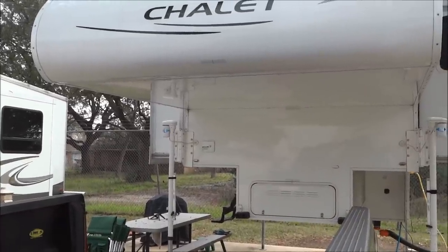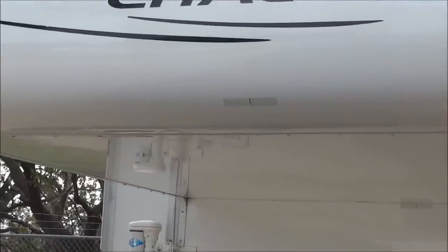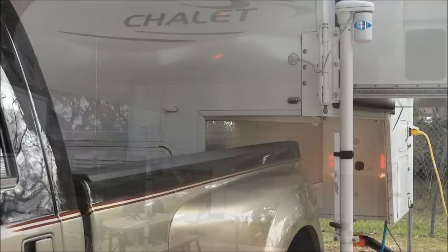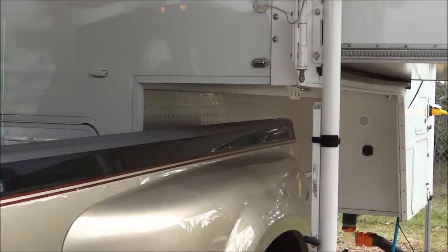Notice now how the line is across all three tick marks — the top one, you can see the laser line; the farther-in one; and the bottom one. So now I know the truck and trailer are perfectly aligned. I just have to go backwards. I always get out and check as I'm doing it just to double-check.